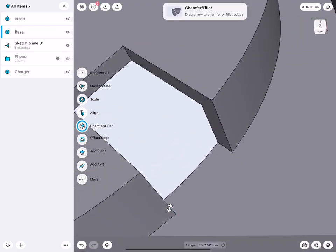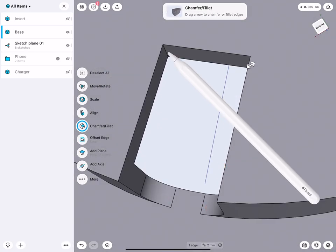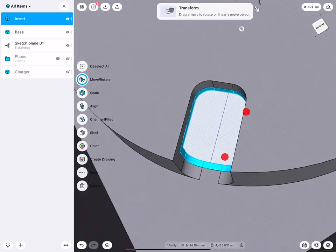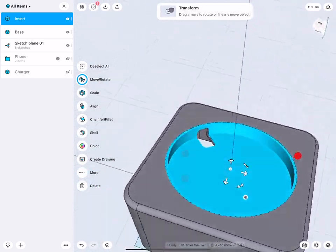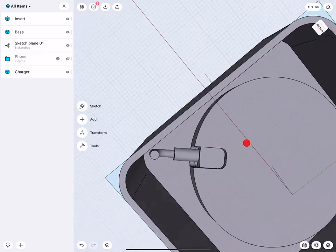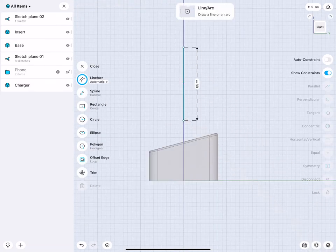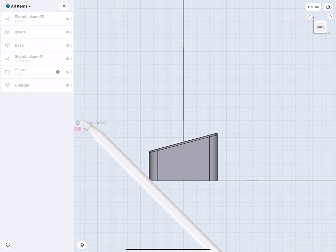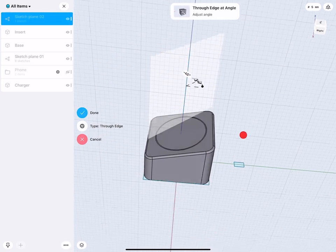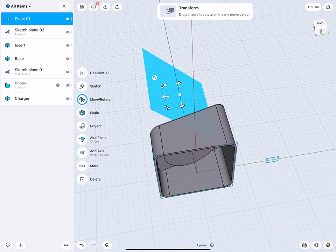We can now go ahead and round the insert edges to make it nicer — 2.5mm. We do the same with the base. If this should be silicone, we can't have sharp edges because they would tear. Round number one, number two, and let's do an overlay — brilliant, very nice. Let's put the charger in and take a look. For a cut section, we make a line here, go to Add and Construction Plane, select 'through edge at an angle,' set 45 degrees — perfect. You can see how we can rotate this view.